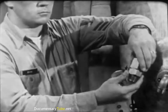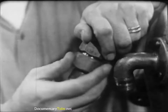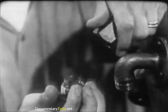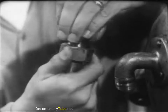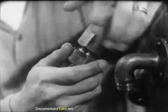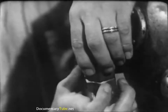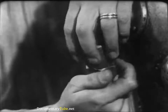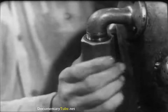There are two types of non-return valves in use. The newer type has a heavier spring inside and the valve body is made in two pieces rather than one. The test is the same — smoke blown into the end of the valve having the female threads should not pass through. Remember, this is one of the diver's most important safety devices. Never omit this test. Be positively sure the non-return valve is in perfect working order. Now reinstall the non-return valve on the helmet gooseneck.